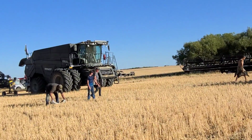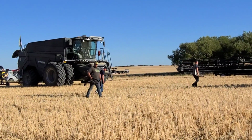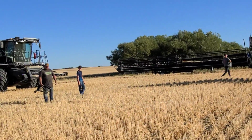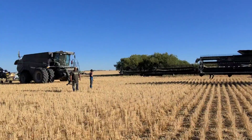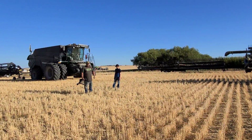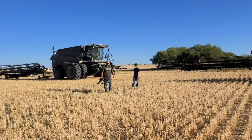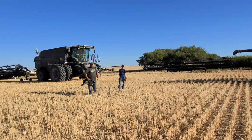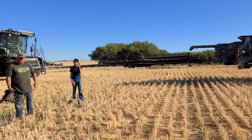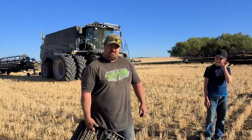Oh, what have we got here? Someone dropped the... How are those going in? Sucks to suck, Mike. Mine went in 10 minutes. You would not believe the issues that we're having. Our sensor bar bolts won't even line up. We're gonna take a drill and drill new holes, ream them out. We even pulled a different concave, put the same concave back, we haven't even got it back in, but we're pretty guaranteed it won't line up. I can't believe yours has gone so easy. I got mine in 10 minutes. That's what I dream of. I dream of 10 minutes. I don't dream because it happens.